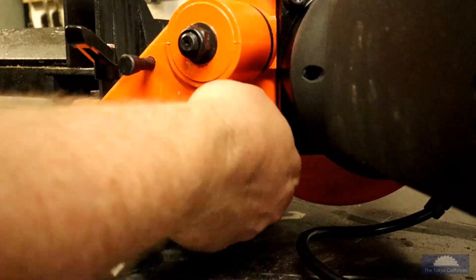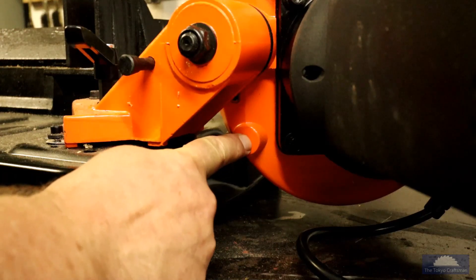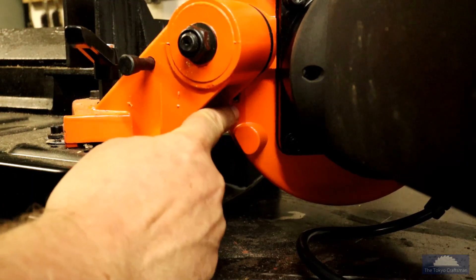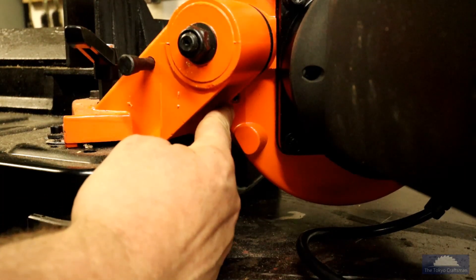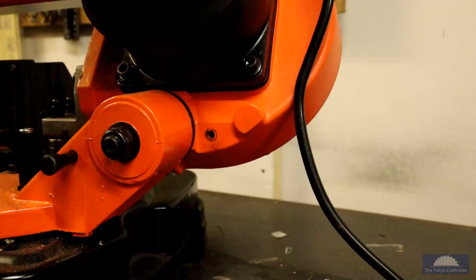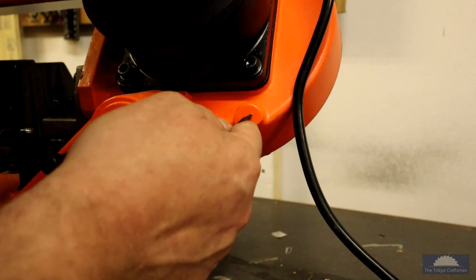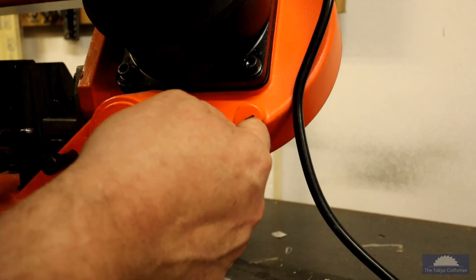It's interesting to me that there's a big heavy boss here. I think what I'm going to do is drill a hole in here and tap it, and make something else that comes off here that strikes against this part of the frame and stops it at 90 degrees. So I'm going to get to work on that now. This should be fairly easy to drill — it's aluminum. I'm going to take my little center punch and bias it slightly back because I might end up putting two holes in there so the thing doesn't move.